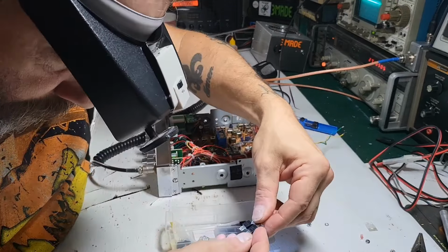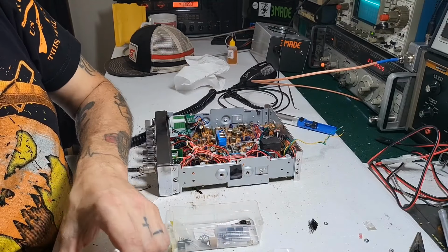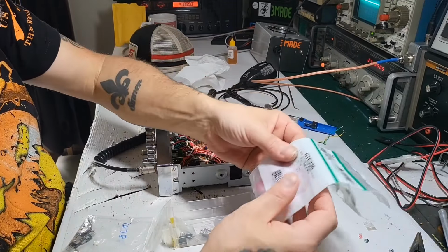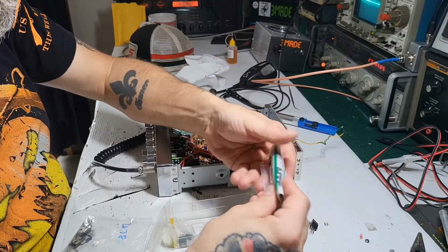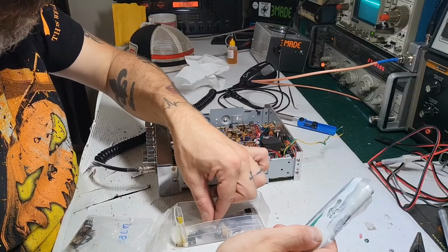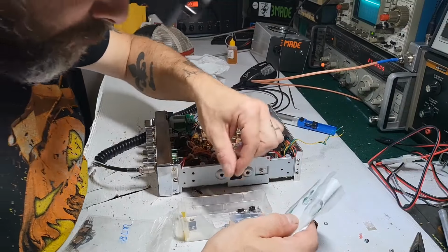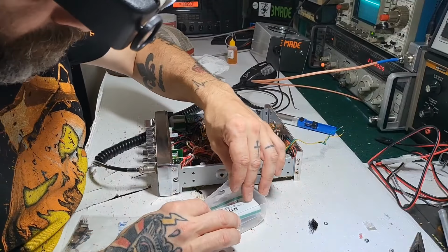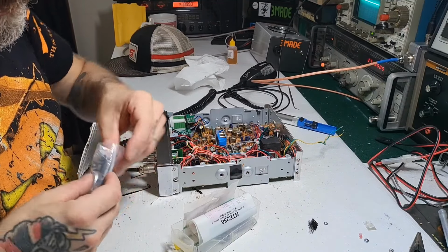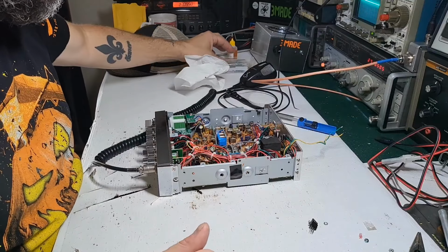If I have one that's long enough. Could also use an NTE 236. These are the replacements for, well, yeah, you could use them for that. Or a 1306. I got a bunch of 1306s, but yeah, you can use a 235 as a driver, 236 as a driver. The NTE 236, I believe, might even replace the 1969s. I forget. I'd have to look at the data sheets.